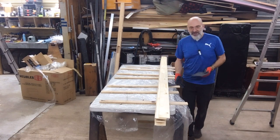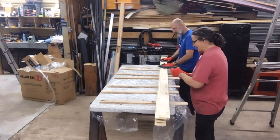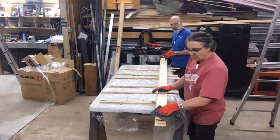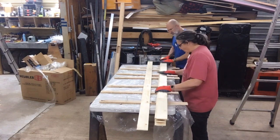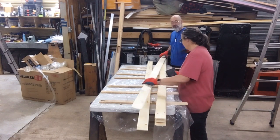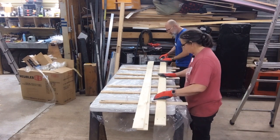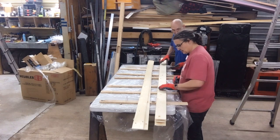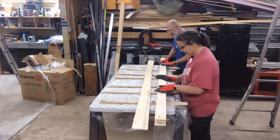So, we've calculated in about 15% waste. It's calculated in that we'll lose 15% of the wood, because when we see that the ends are no good, we'll cut them and remove the material we don't want to keep. What doesn't look good, we'll be cutting out. Obviously, we don't use full lengths everywhere, so it doesn't matter if we lose a little bit here and there. Where the knots are solid, like here, or along this whole plank, not a problem, we'll be using it. When the knots are loose, we'll be cutting around those loose knots.